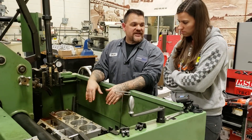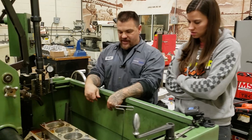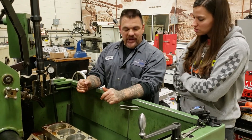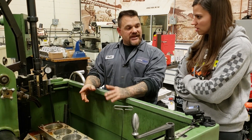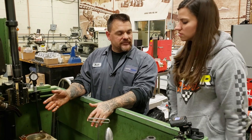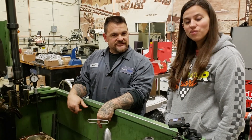So that's what I've already done to your block. We're ordering a 4.075 from CP Pistons. They're making the pistons now. We've got the block deck done. Next step: we'll put the main studs in the bottom and we'll start line honing the block.